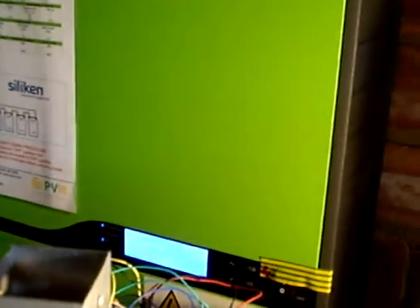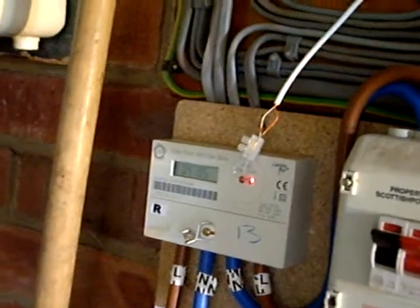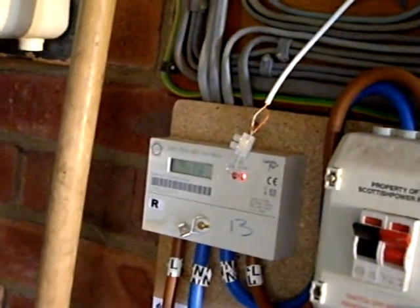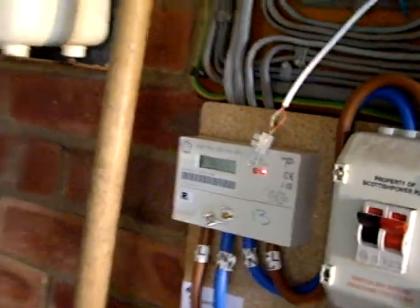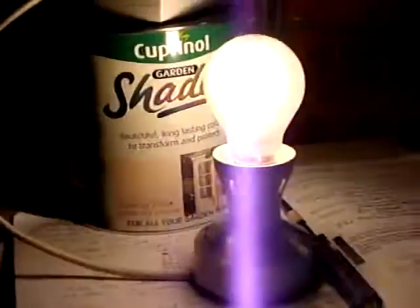At the moment we're getting a thousand watts from the PV. I've got an LED on there just to see what's going on, but it's not doing anything active in the sketch at the moment. We're exporting, generating a kilowatt of power. The little yellow LED on the Arduino is on, which shows that the Arduino is putting out and the triac is hard on, which is why the light is in that state.